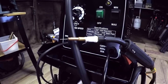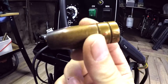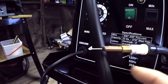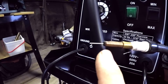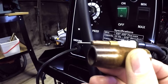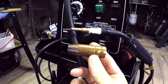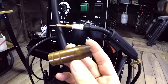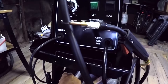This machine and this wire obviously do not require gas, so this nozzle is not necessary. It just gets in the way and sticks out too far from the tip — probably an eighth or almost a quarter of an inch beyond the tip. This is the contact tip — that brass piece — and this is the wire. It makes it really difficult to get the proper stick out and to see what you're actually doing. So one of the first and easiest improvements is to remove this nozzle, and this one just screws off.